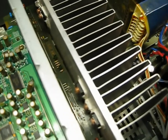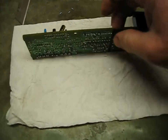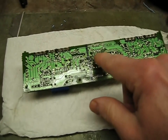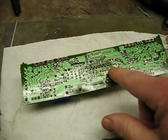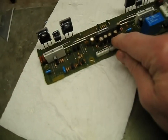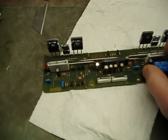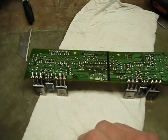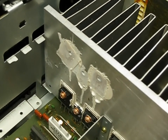When putting it back together I have to clean off all the heat sink grease and apply new thermal grease during assembly. Here's the rear amplifier board that I removed — this is that NEC chip that gives the problems. I found it looked like this board had been removed once before and a few of these had been re-soldered — like three of them, not the whole bank. So I redid the whole bank. Along here there's some small resistors that looked a little iffy — they're 1/8 watt resistors — so I just went ahead and touched them up anyway. Anything even slightly questionable, it's easier to just touch it up and reflow a little solder.